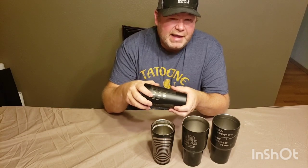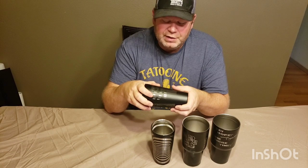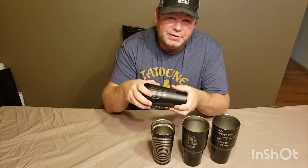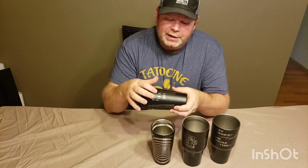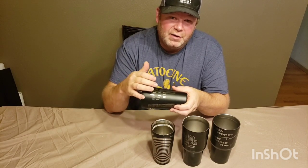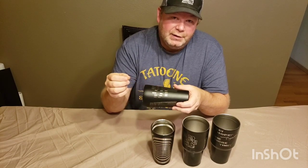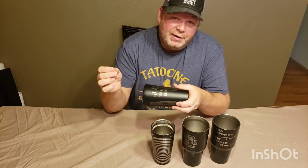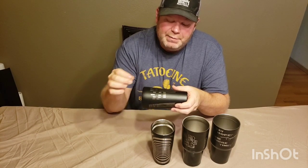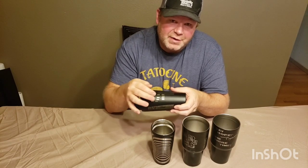And when I saw that, I thought, to me that looks like it's overburning. I'm burning way hotter than I need to. Typically when you burn off paint, either it comes completely off by itself or just a light brushing will remove it. If I have to take a magic eraser to get that soot off, I'm burning so hot it burns the paint off, and then it's re-burning and re-melting the paint and reattaching the soot back to the can, and that's what I'm scrubbing off.